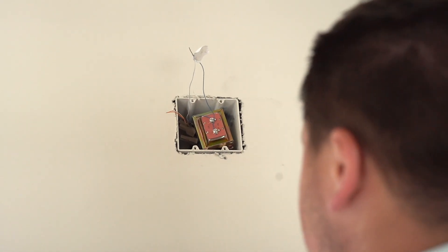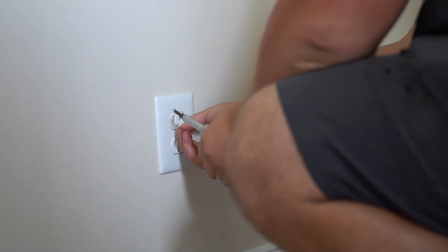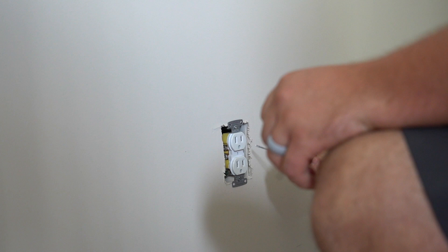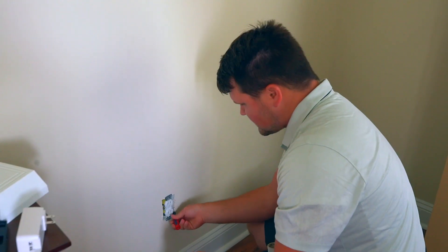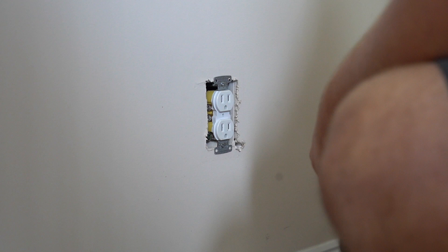Before I do that, I'm going to find out what side the stud is on. Stud's on the left, so I just want to make sure I'm over on this side. Just on the outside of the box, I'll pull a small little hole, just like that. One down here at the bottom too. I like to take the plate off so that when I do my hole, I'll be able to cover it all up with the plate. I want to double-check it's the hollow side - see how it goes all the way in? That means it's hollow. So I'm just going to drill my hole in the bottom corner, just on the outside of the box.